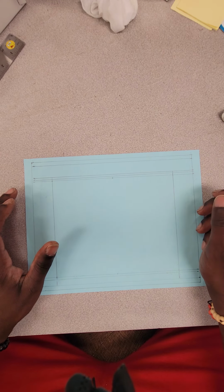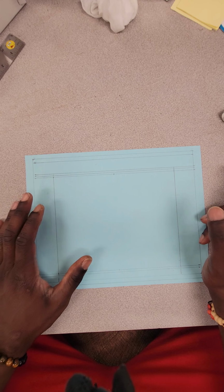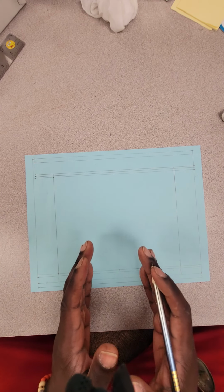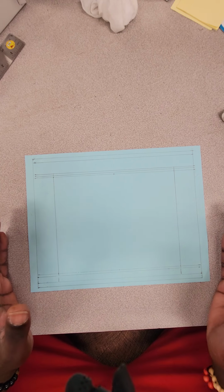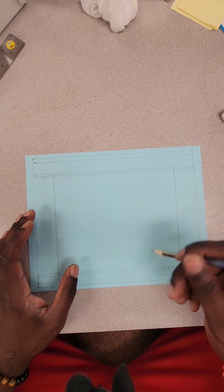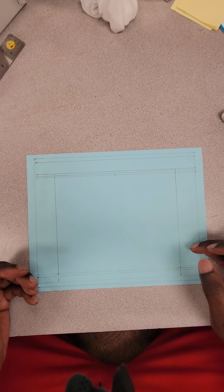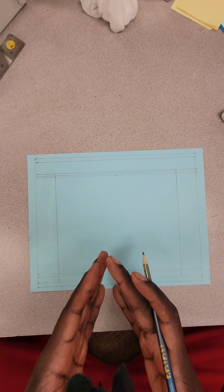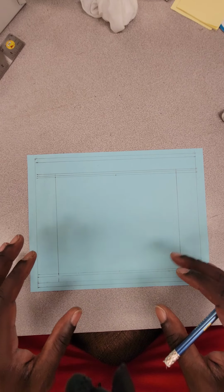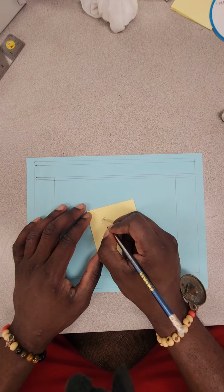And the difference between what you would do on paper and what's going to happen in actuality is going to be one of the biggest factors you're going to have to keep in mind when you're doing drawings, because you're drawing to scale, and then the person doing the actual layout will be drawing to actual layout. So they're going to have to include more things than were actually on the paper. These are some of the tricks of the trade. You'll just be drawing a 2-0 or 3-0, which I'll explain in a second, or they will have to add additional measurements to the layout from what you originally put in. So you'll draw strictly what it is, the 3-0, 4-0, which is basically the door opening. This 3-0 was established.